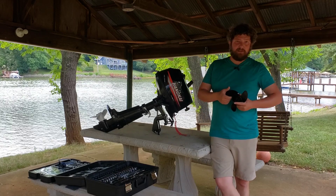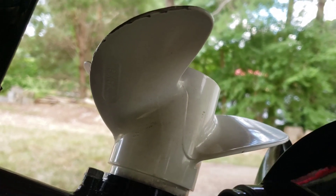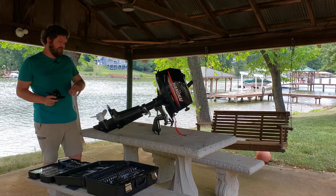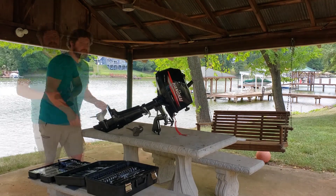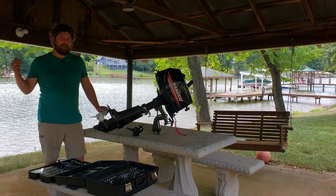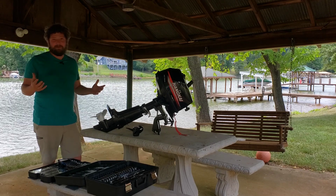One of the comments we got was to change our prop. The white prop that came with the engine is a 7.8 by 8, and the prop we were suggested to use is a 7.8 by 7, which should allow for a little more thrust to get us up on plane. It won't change the speed per se, but it should get us to plane so we can do 13 miles per hour instead of plodding along at 8. Today we're going to change it out, then head out on the lake — we're throwing my engine onto the white dinghy to test it, since mine's still packed up from the ICW.